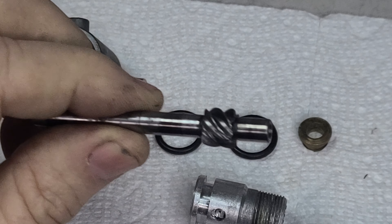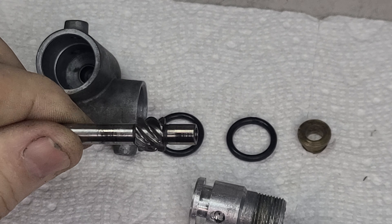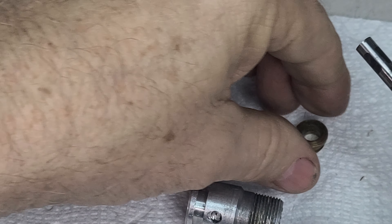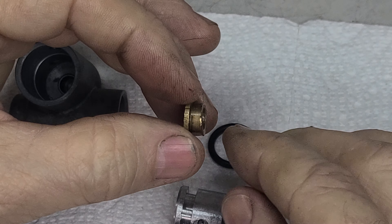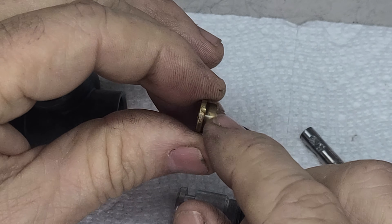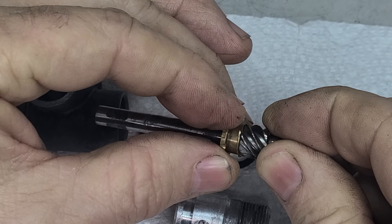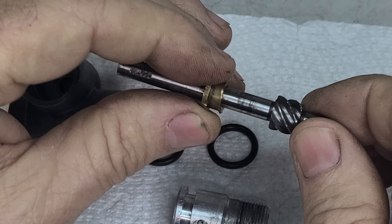This gear is the worst of the two — and if you can see this, it definitely has some problems. Something got into this thing and chewed up the teeth a bit. Another factor with this gearbox is this part here — I can call it homemade. It's narrow right here, then gets wider, and there's an edge on it. So when it's on the shaft, look how loose that is, and the gear can kind of catch on it.